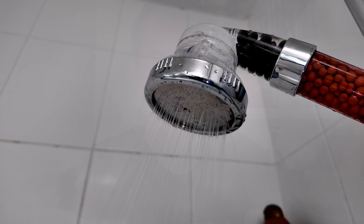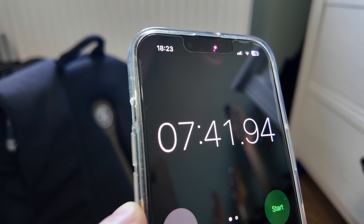A rather unexpected result. I ran the shower for 5 minutes at around 6 litres per minute — the water was still really hot, comfortably hot. I then fully opened it to probably 8 or 9 litres per minute with that shower head and flow limiter, and it ran until 7 minutes 40 seconds before the water started cooling. With 60 litres capacity, it should be comparable to a 60-litre vented cylinder — if you run 7 litres a minute and mix in some cold, you should get 10 minutes of nice showering just from the store. If you raise the temperature to 60 or 65 degrees in winter, you'll likely bridge the 5-minute defrost gap.